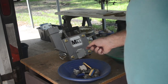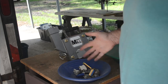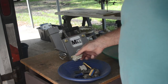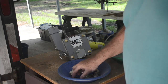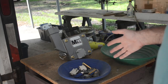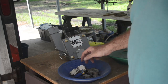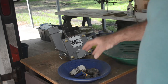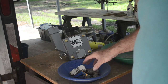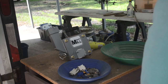So some of these connectors I think are going to soak up more pregnant solution of Eco Goldex than they're going to release in gold. So what I've been looking for is a way to shred these, basically - tear them up into little pieces. Whether I can separate the plastic and the useless metal out or not, at least they'll be shredded. I could run this stuff through Eco Goldex or some other gold plating stripper, get the gold off, and this stuff wouldn't trap a lot of the pregnant solution. We'd get a much better yield.